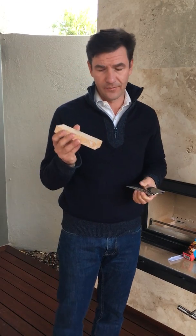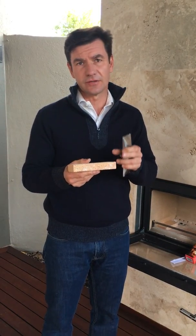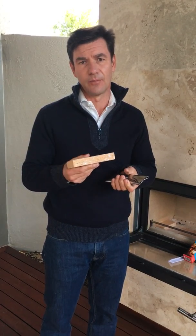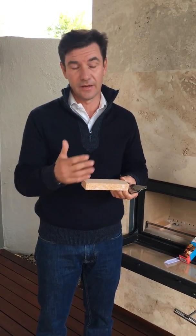I just want to talk about fire bricks themselves for a moment. Fire bricks are kiln-fired to a higher temperature and contain less moisture than a regular house brick or a paving brick, and for that reason they're designed specifically for high temperature combustion wood heaters as a liner.